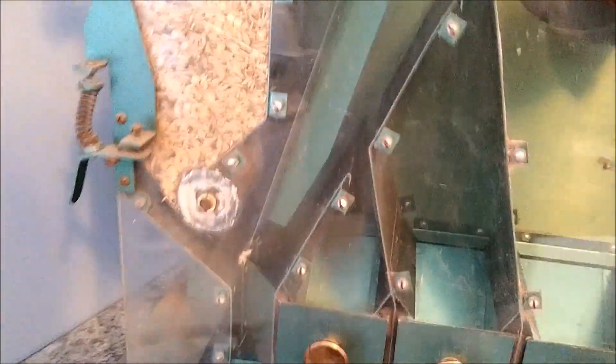I have the sample in the fractionating aspirator and we're going to go ahead and start it. I've got the feed roller turned off right now, so I'll go ahead and increase it slowly. This has a lot of heavy oat contamination, so we're going to run it slow, and we're going to have to monitor our fractions because they will fill up and we will have to stop.